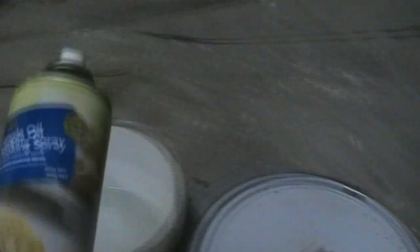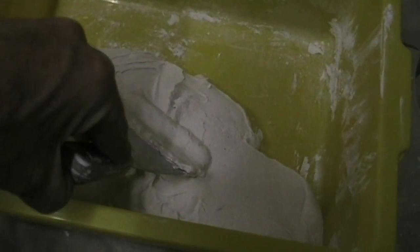Don't go just yet. Remember earlier in these tips I showed you about the cooking spray? Remember how we sprayed it in the pot? I said that by doing that it makes cleaning up really easy. Well, I've let the cornice cement go off - this is what the end result is. It's gone rock hard. So if we just prise this off - there you go, look at that. Beautiful and clean. That's priceless. See you next time. Ciao.